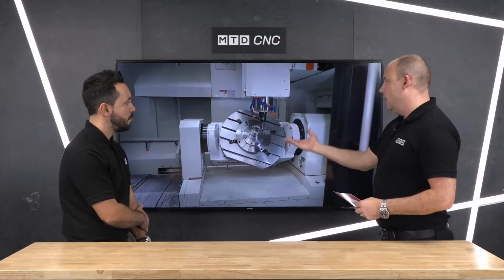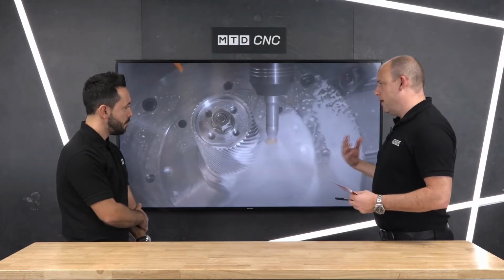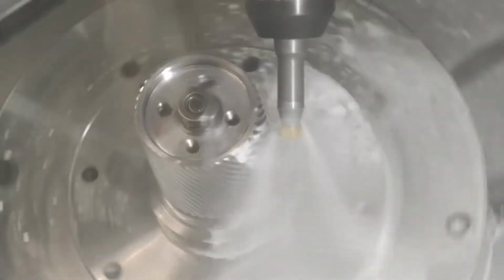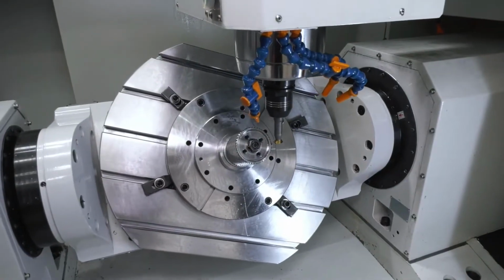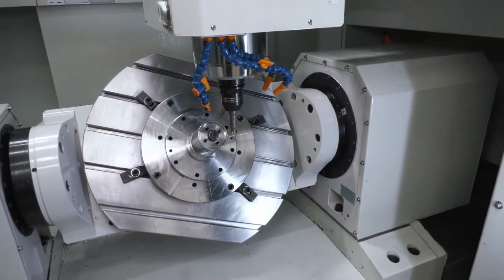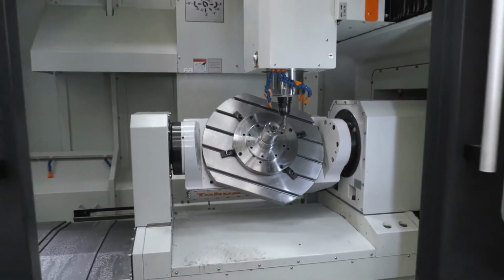This is where a lot of machine tool manufacturers are now trying to produce machines that are capable of doing multitasking and different operations. And gear cutting, obviously, is one here. Now, there's a lot that goes into it. It's not just the hardware, the software that needs to create the cycle and the paths for the machining, but to get the standards of accuracy that you need for some gear cutting, you need a machine that is ultra precise.